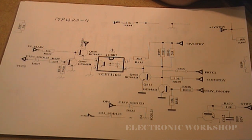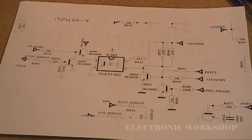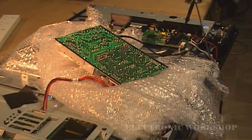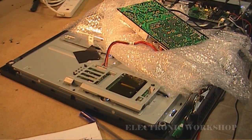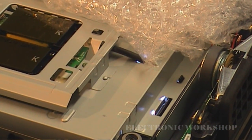Those old boards had chopper transistors blown — that's common enough on the primary side of these. It doesn't usually present as this type of fault, tripping as it gets warm. But if we look at the LCD I have the power supply plugged into, you can see through the back the backlights are still up and working — you can see the light shining through the metal part of the rear of the screen.